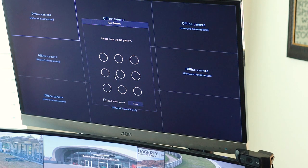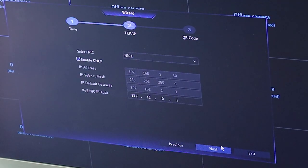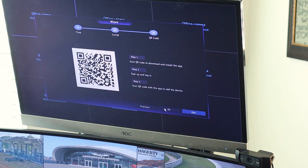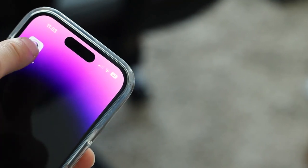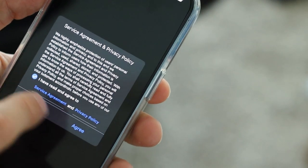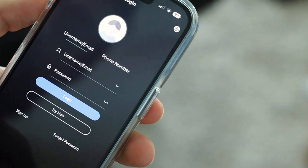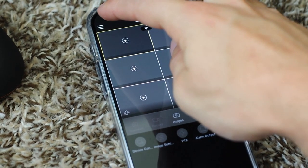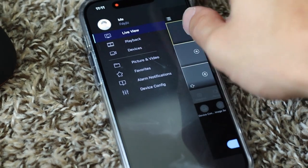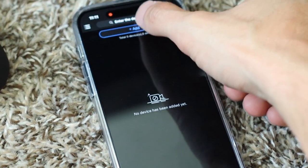Don't forget either password. Set your time zones, go ahead and enable DHCP. Now scan that QR code with your iPhone, Android, or whatever you have. Plug in the ethernet or LAN cable. Open up the app that the QR code sent you to, which is Guard Viewer.